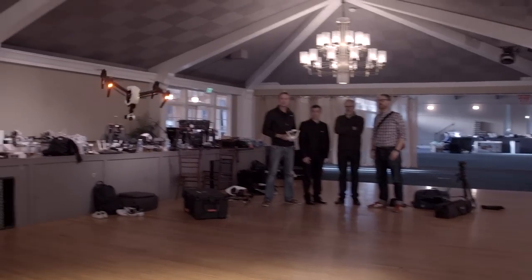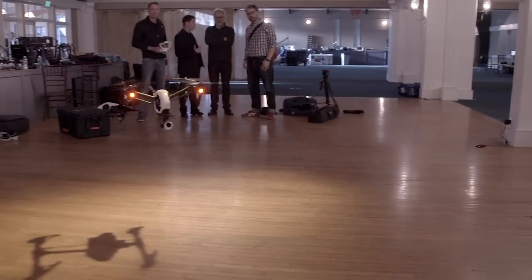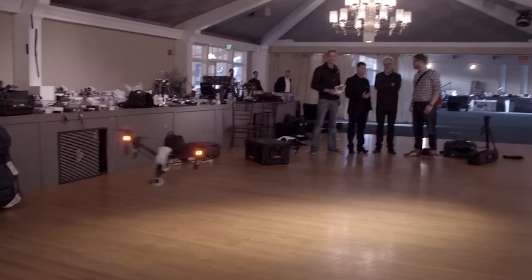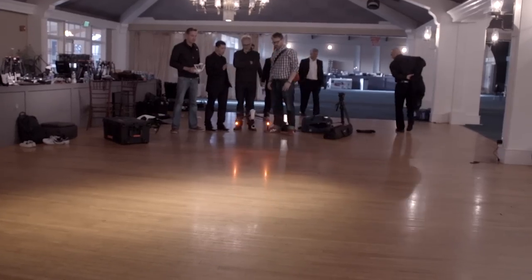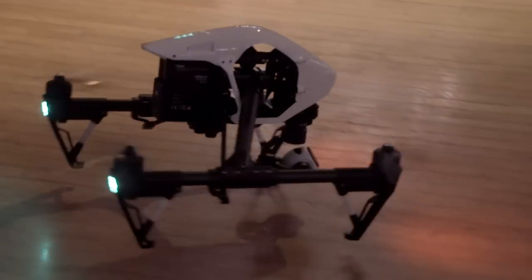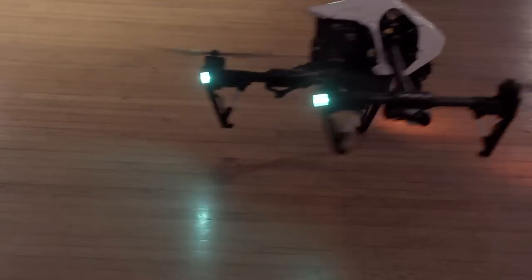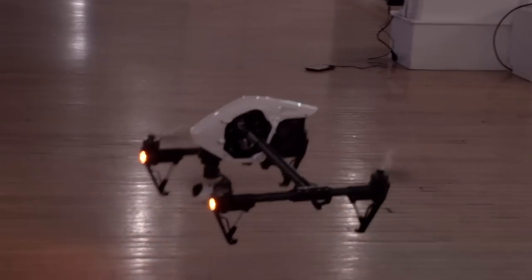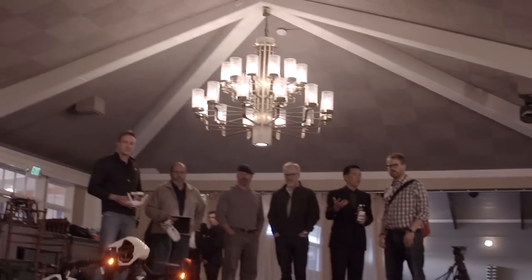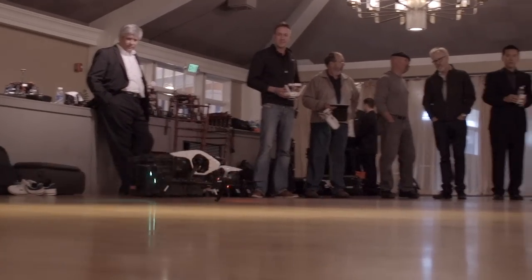When the drone comes in and lands automatically — whether it's lost signal or the battery in your controller died or whatever — it's not going to slam down hard because it thought it was three feet higher than it was. Previously these used to land by descending slowly until they stopped descending; they weren't aware of what was below them. But now we know exactly how far away the ground is and what direction it's moving. So you can hover it right above the ground, which is rock solid in position hold. At the Treasure Island demo, Eric was flying with one of the landing skids on the dance floor, skating in figure eights. The optical sensor works similar to an optical mouse.